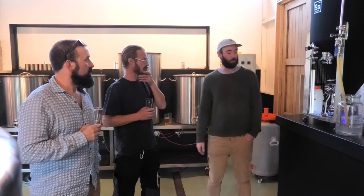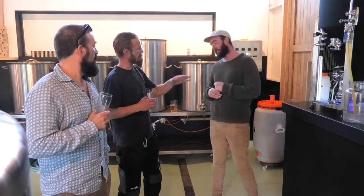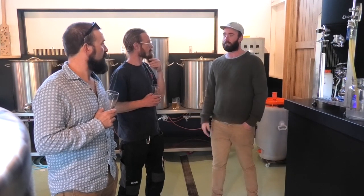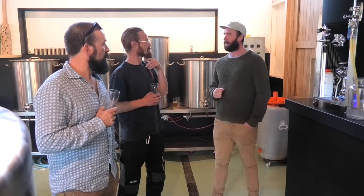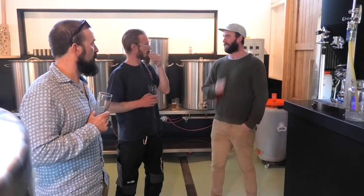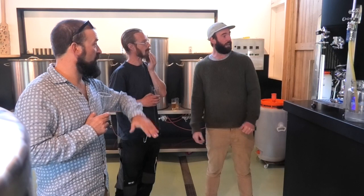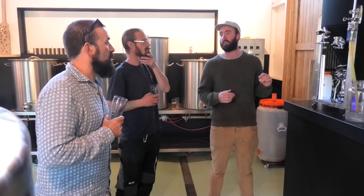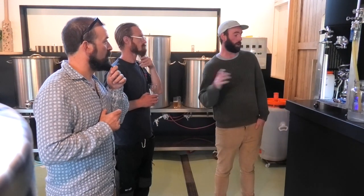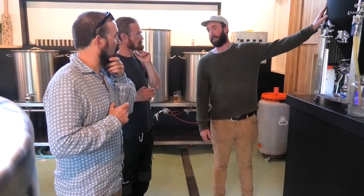Because we're doing everything as an ale at the moment — we haven't done any lagers — we're filling these fermenters. It's coming out of the heat exchanger cold, at 16.5 degrees. You're running cold water through the heat exchanger, capturing that heat for the next brew. The wort has gone from around 100 degrees down to 16.5. That's critical — it's got to be 16.5 degrees when we pitch the yeast. In the height of summer using ground water we don't quite get it down that far, so the glycol chiller in here typically takes it down to 16.5.